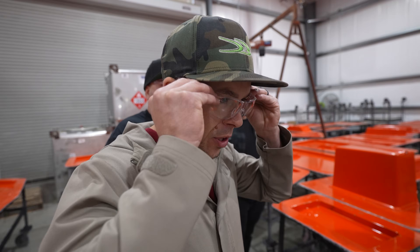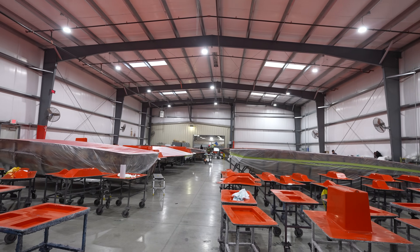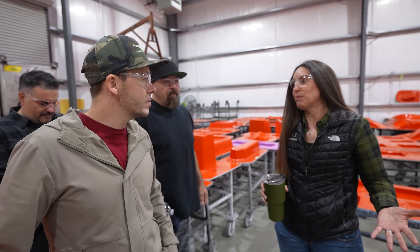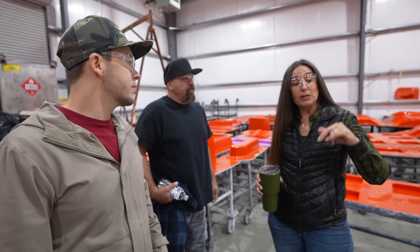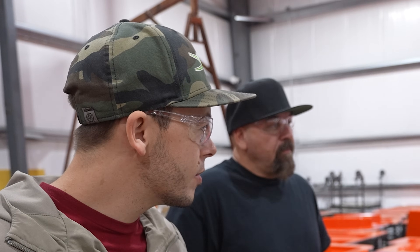If we screw this up, you're going to see it on the exterior of the boat. So we are now in mold prep. If we don't condition the molds properly, you'll see any blemish that's in the mold transferred to the exterior of the boat — and that's a problem because it'll need to be fixed on every single part that's pulled out of that mold. So it really makes sense to take extra time here. Between turns, every time we use a mold, we wax it.